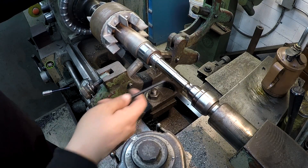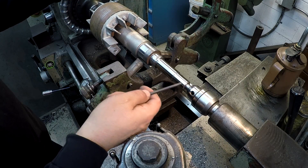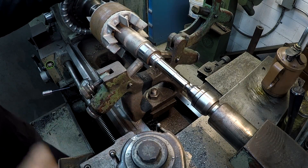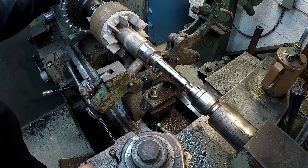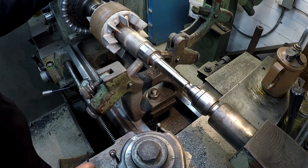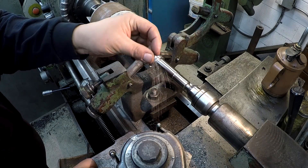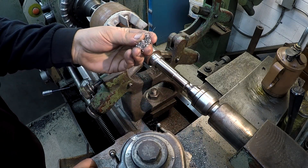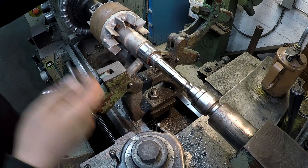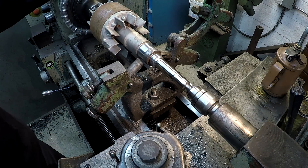There she is, finished up. I got both of them polished down to size and they're both dead nuts on — this one is 875 and this one's one inch. That stuff actually machines nice and it finishes nice. It leaves a nice shiny finish. It's kind of like machining stainless but with the chipping action of bronze — that's kind of what it's like. Next step, I got to go to the milling machine and mill that 3/16th keyway in, and then this thing will be done.